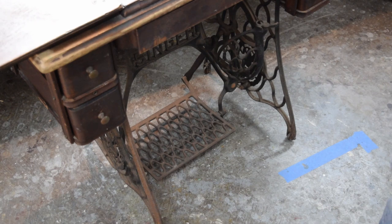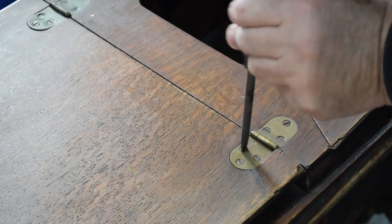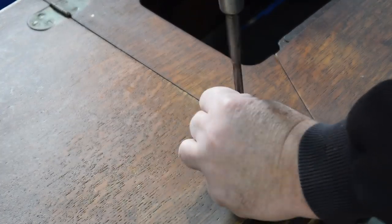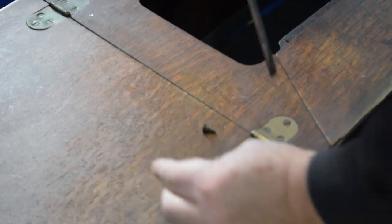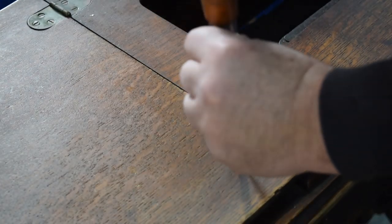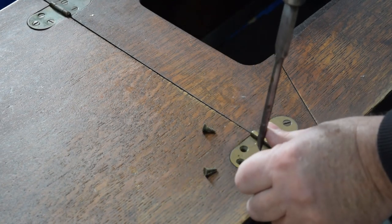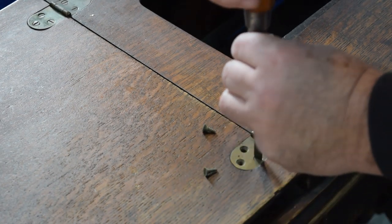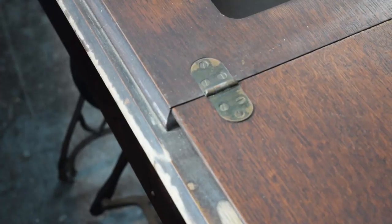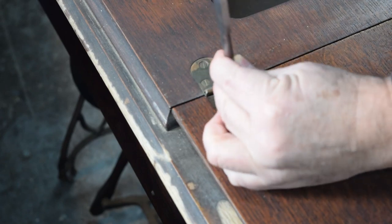We'll get this top off and we'll flip it up on top of the workbench and disassemble the base. And obviously to get the lid off, all we have to do is unscrew these screws. Remember, in this lid assembly, the screws are different sizes. You don't want to mix them up or you'll be punching a screw through your new work when you reassemble the machine. And on this second hinge, you can see it's bent up, so we'll have to repair that.